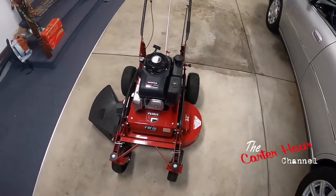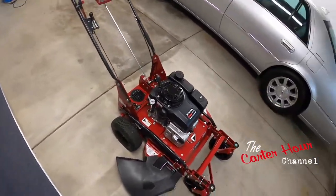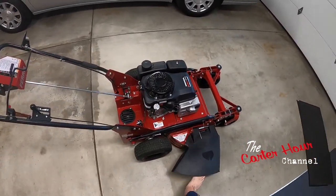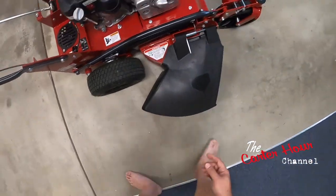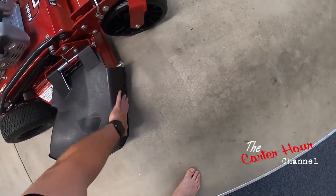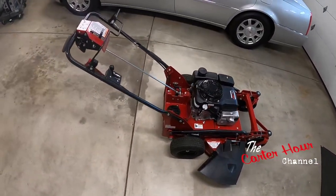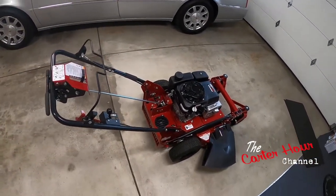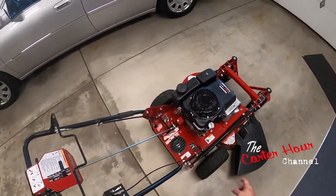The cut is beautiful. It's got timed blades on it so you don't get that little strip of grass between the blades — they're interference blades that actually cut that path as it's going. It has a timing belt that keeps the blades in time. The chute is engineered pretty well for this mower — it's open in the back area but shielded in the front, so it distributes the grass well and doesn't leave a little trail unless you're cutting some heavy grass.